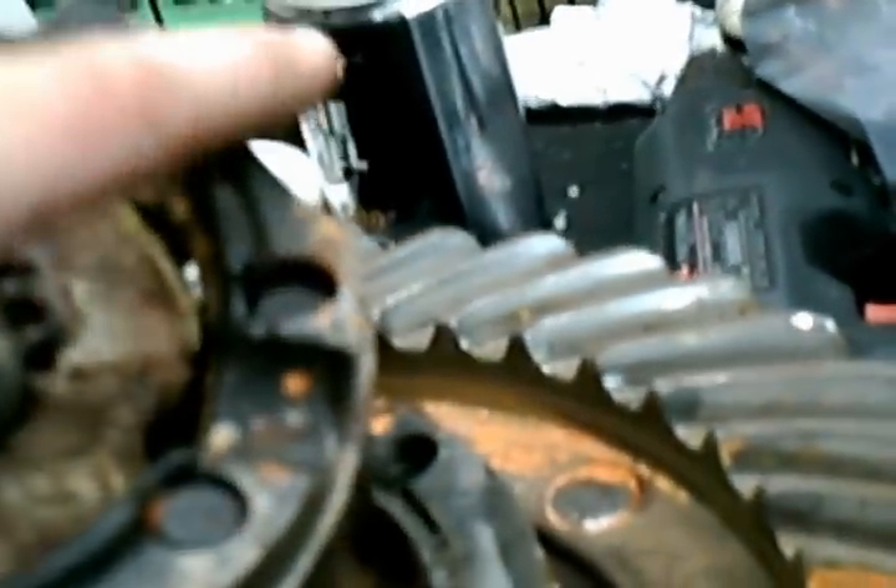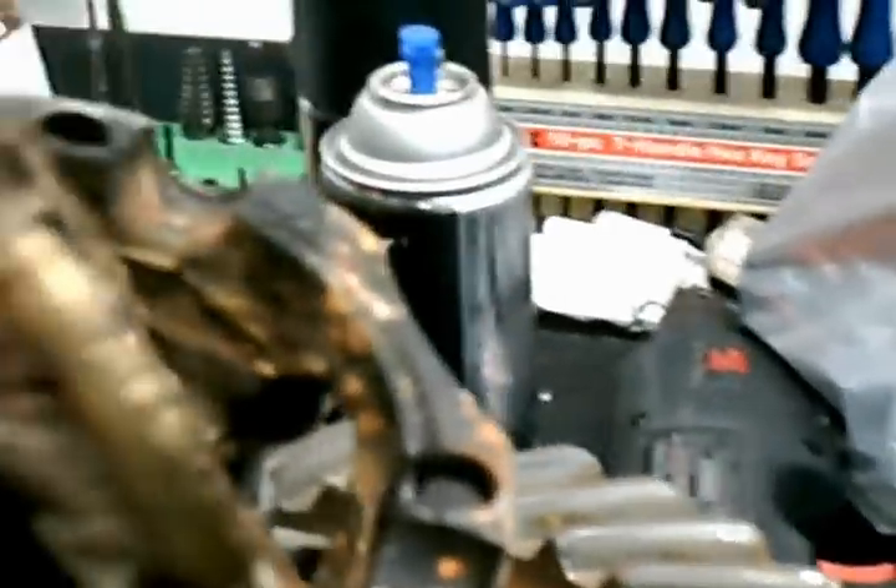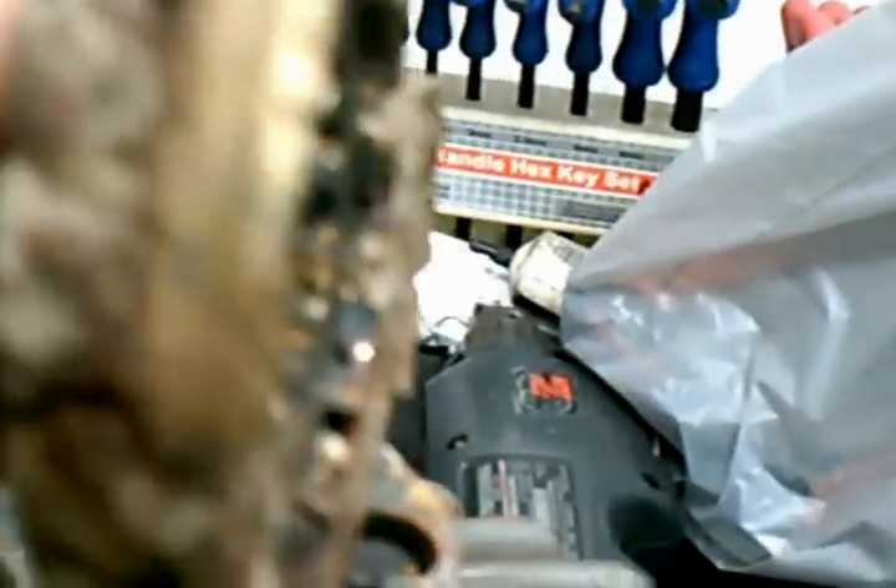This is not no big deal. I'll put this in the lathe and turn this brass off of it, then clean this up down in here, drop it back down in there, and use a MIG welder and weld everything back up solidly — and we'll have two wheels pulling again. There's nothing way beyond repair. Of course we've got the bent brake rods and stuff to fix, but that will come at a later time.